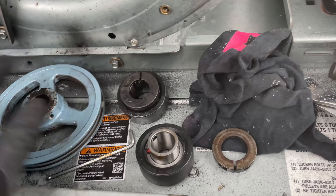This is the new bearing — a new bearing with a different style. They do not need that kind of collar to hold the bearing to the shaft. We just need to place the bearing on the shaft and tighten the set screw. Both bearings are in, pulley is in and aligned, belt tension is okay, and the rotation is smooth. Let's test it.